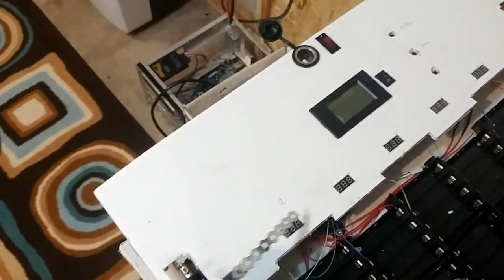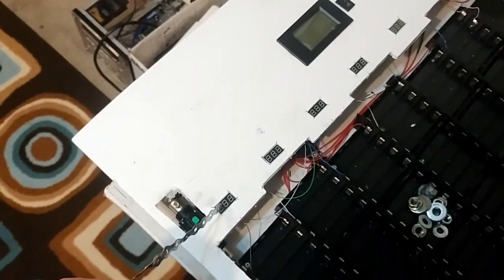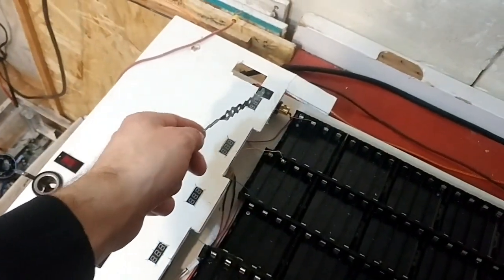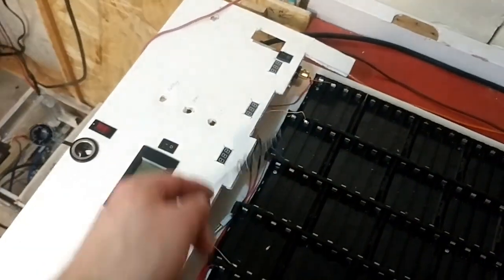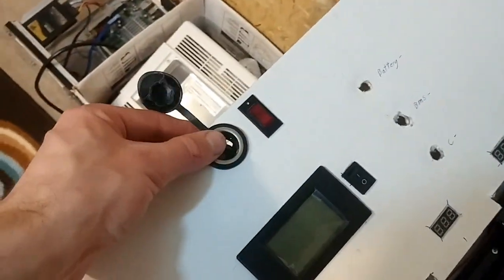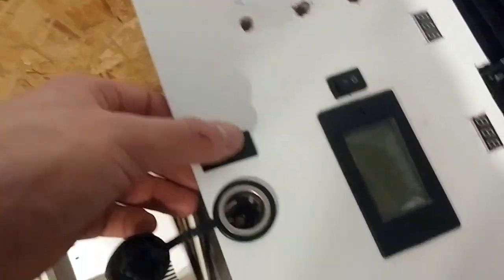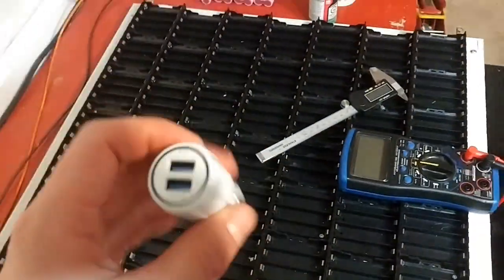It is a lot of work, but only because of these voltmeters. If you get rid of the voltmeters, that's a lot of tiny holes, right? 7 holes for that, and then another hole, and then all of the soldering. That's a ton of soldering. I really like this, and the way, see, it has its own on-off switch, because this guy has an LED light and he drains power, so this is a completely separate circuit.